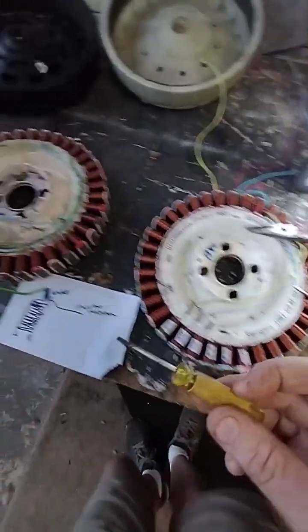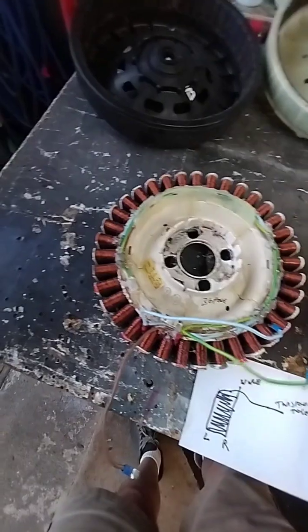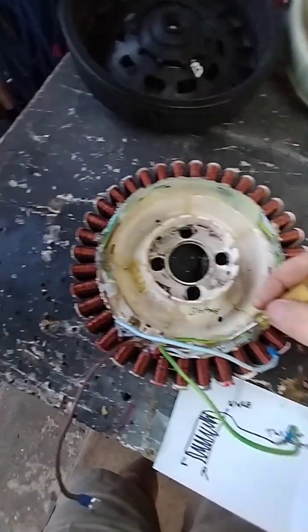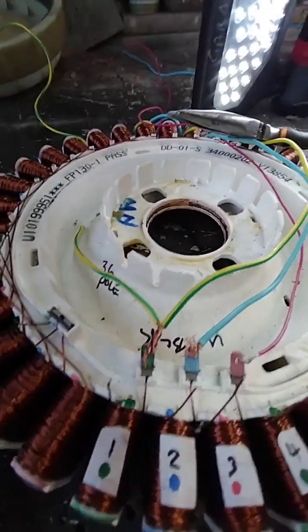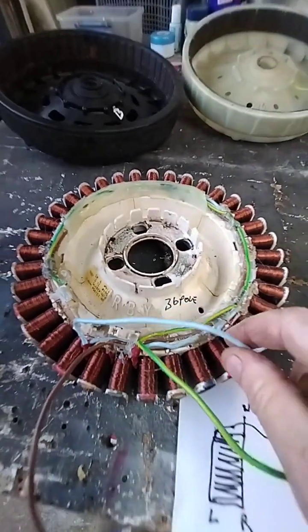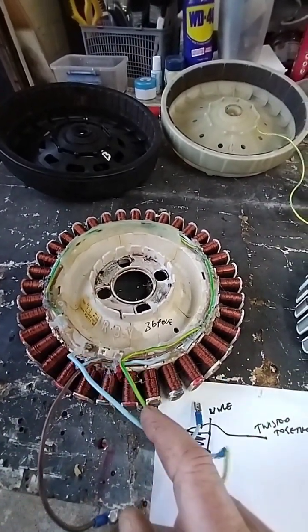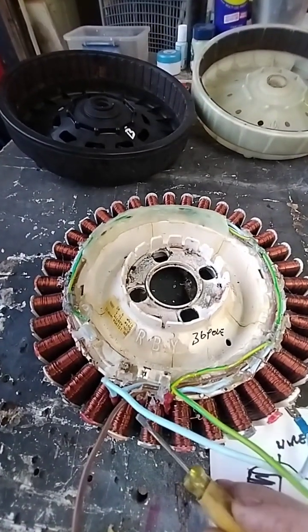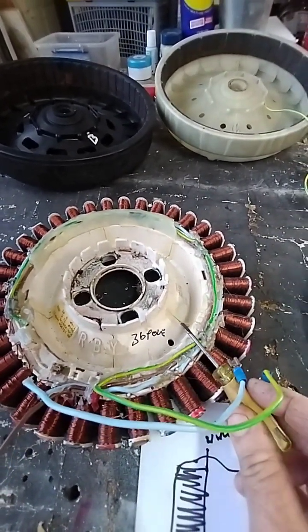Remember back to last time — this was our prototype, and we ended up with three phases, or three wires. In this case I used a green, a brown, and a blue, but I changed the colour coding on this one to make it clearer. What we ended up with was these pigtails, and that's where the three phases come from — that goes to your rectifier. Now we've got to figure out how we're going to cut these and join them each into a different wire.